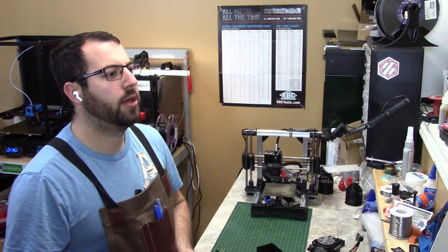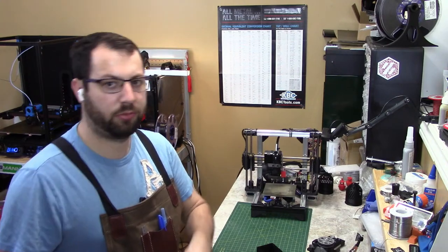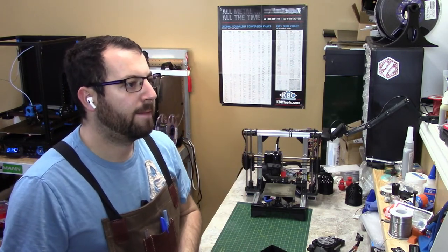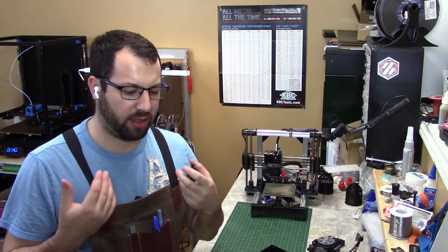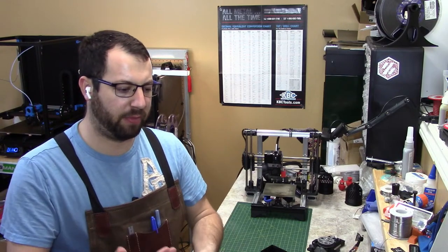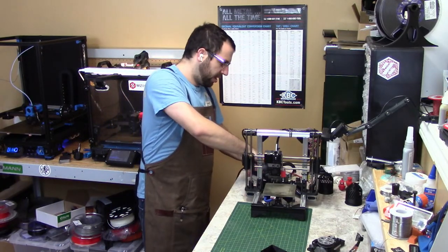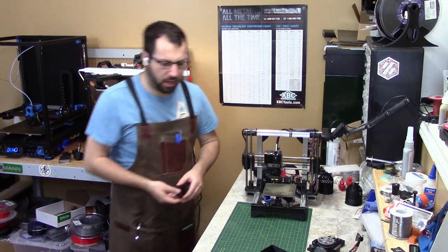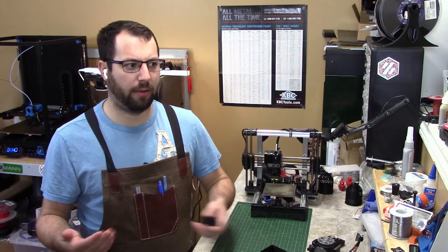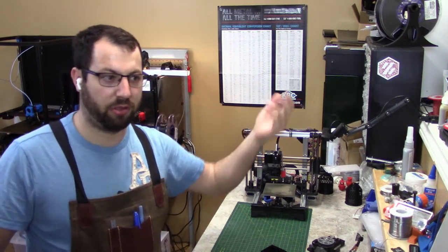You can go big with CoreXY. The problem is if you're trying to do Voron stuff where you're trying to print 300 millimeters a second at 7K acceleration for stupidness, which I don't normally print that fast. I only print that fast just to show that I can print a Benchy at 300 millimeters a second. But you build a CoreXY because CoreXY is a light, fast motion system. And once you go beyond the point where you can go light and fast, it's points against it. That's my whole reasoning. It's like you're building a sports car out of carbon fiber because it's light, but then you're building a motorhome out of carbon fiber with a four banger in it. I'm maybe defeating the purpose is the proper term. That's my thinking. Obviously, everyone's entitled to their own opinion, and if you can build it and it prints great.